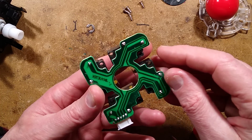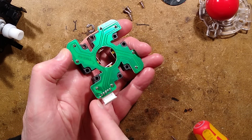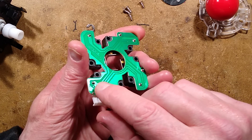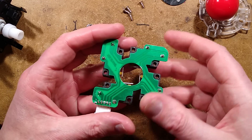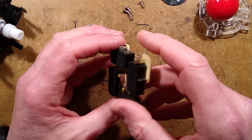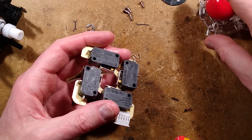The text is back to front on the board — it reads J-N-Y-U-E-T-E-K. Basically, it's a common connection that goes around to one end of this connector, running around all the switches. Then the other connections individually come back, and you can just work it out yourself — whichever one you get, you can probe and find which switch makes in which position. They're quite stiff switches, but they're standard micro switches. I wonder if the joystick is used with force whether it's relying on the switch for end of travel, which could potentially flex these connections and break solder joints — an easy enough repair, though it is relying on that for mechanical purposes.